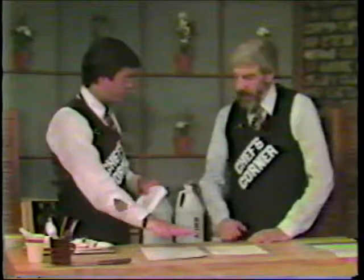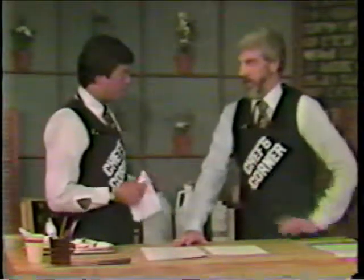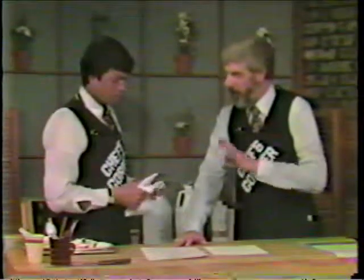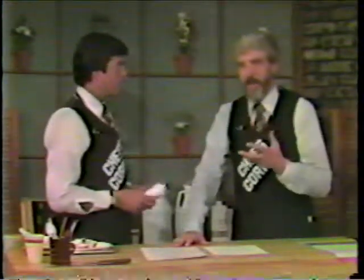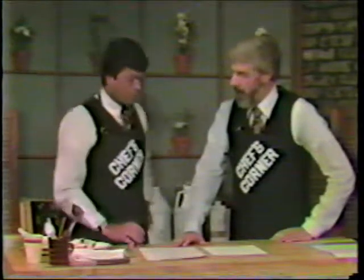And to use that, there is a toner that's recommended for that, the 4-3792 toner. So you have to use special toner with special masters, and it goes in the separate tank. Different parts of the country use different mixtures of the toner. We will talk about that in greater detail on another program. But suffice it to say now that people should be guided by the technical department in their particular location, setting that up correctly. And again, the Offset Supplies book has the recommended supplies.